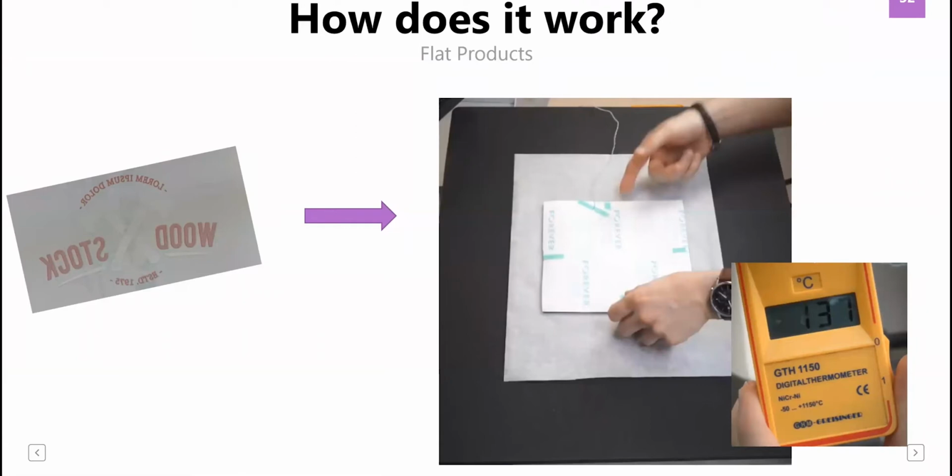So ceramic, metal, glass, you name it. Because say if you're using a 3mm piece of glass, and then the next time you use a 10mm piece of glass, it's got a different mass. So if we have it at a set time in the heat press, then the different thickness piece of glass is going to take longer for the surface to get to that particular temperature that we need for the bonding process to work.